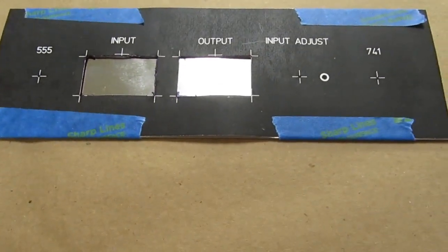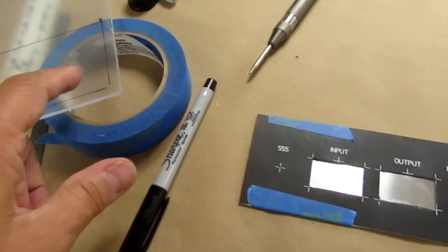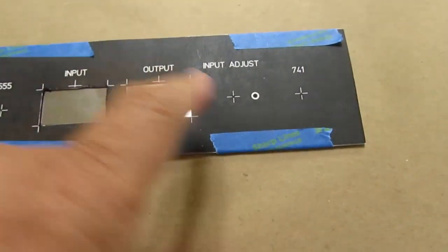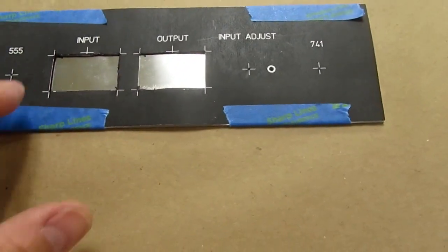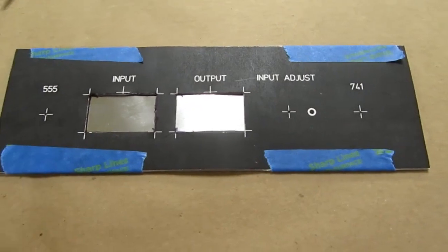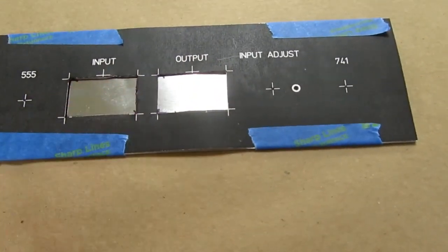So I think the next thing to do is to peel the acrylic off of just the part of the front where I'm going to be sticking this on, and then stick on the aluminum. Then take it over to my scroll saw and my drill press and cut out the holes just in the aluminum and the plexiglass. The aluminum should support the plexiglass a little bit in that. If there's any cracking of the plexiglass, it'll be hidden by the aluminum, which is the real structural element. And then I'll put it on the scroll saw and cut the square parts out.